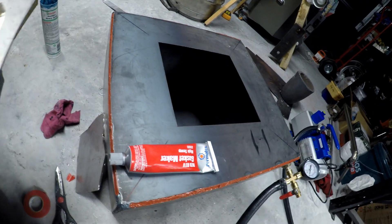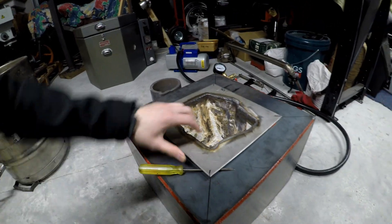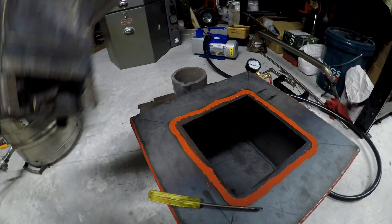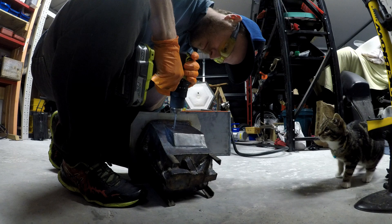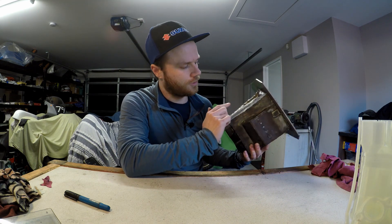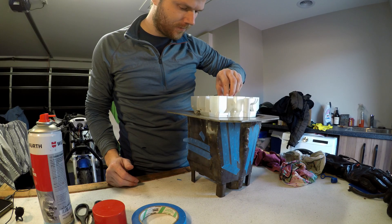My plan to make this seal against my vacuum box — I've cleaned the surface and I'm going to run a bead all the way around, a nice thick one. The seal is now set because I left this to dry for a good few days. That looks good, I think that'll work. My flask modifications are pretty close to complete. I've drilled some holes in it — the hole locations are pretty limited and I've got them on three faces. You can have a blowout where molten metal comes out of the flask if the wall thickness of the investment is too thin. The mould is ready to go in the kiln and get burnt out.